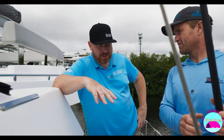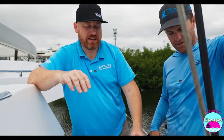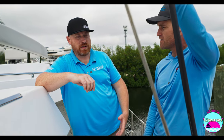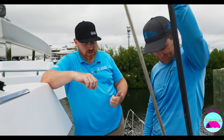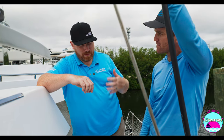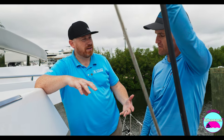From a load sensing point of view, it's an inline load sensor which gives you superb accuracy. On top of that, it's all based around an open body turnbuckle design, which means it is a straight swap in and out for an existing component. We just put this in here in less than five minutes — a bit of Tef-Gel to stop it from squeaking — and it's there. No rig adjustments needed, it's straight in and straight out. It's fully wireless, no holes going into the boat, and it's battery powered. The batteries will last around about a year, so at your yearly rig maintenance check you just swap the batteries out and keep going.